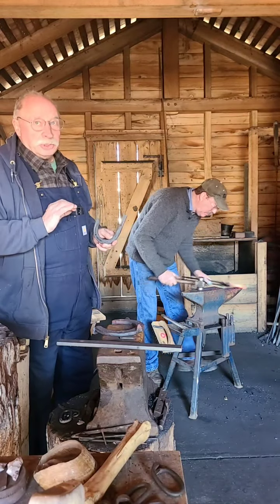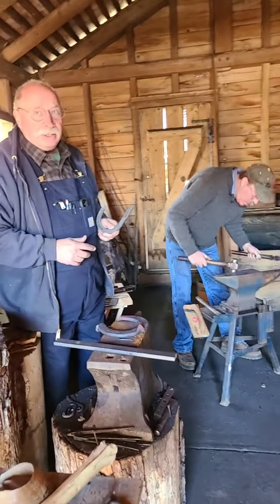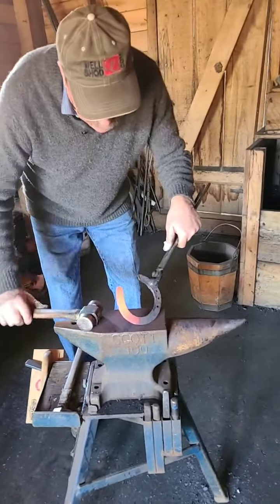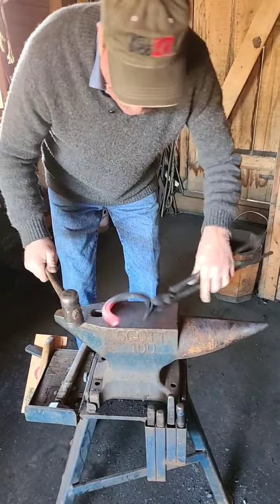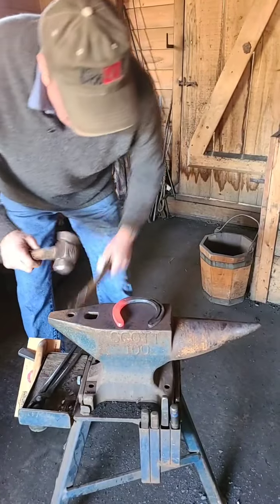Like a shoe, as far as we're concerned, and what we normally think of as a shoe, this is about to look like a shoe. When you bend it, it crumples up on the inside, so you have to forge that back out. Not only the nails, you can't put pressure on the sole with a foot, or that'll make the horse sore.